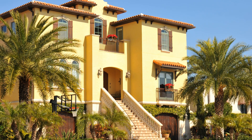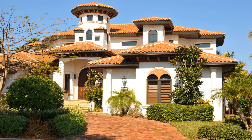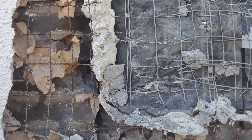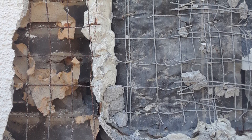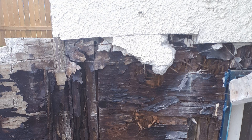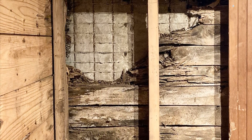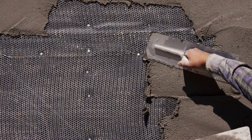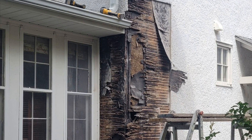Another type of reservoir cladding commonly seen in the south is stucco. Stucco is extremely common and is often applied to wood-framed walls, typically separated by a couple layers of tar paper. The first layer acts as a bond break and the second layer serves as the primary water control layer, but sometimes we see stucco applied directly to a single layer of the WRB or even directly to the sheathing. We tend to see a lot of rot in these types of walls if there was an attempt to insulate them in the past. If the walls are uninsulated, moisture issues are less common because those walls can actually dry out unimpeded.